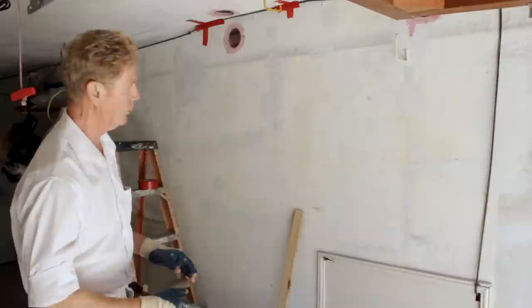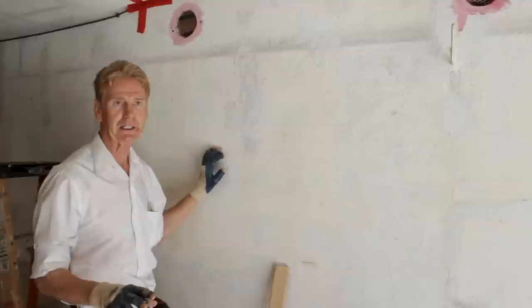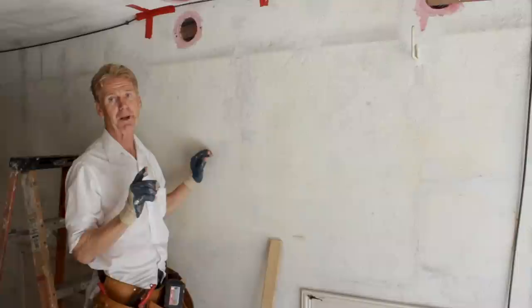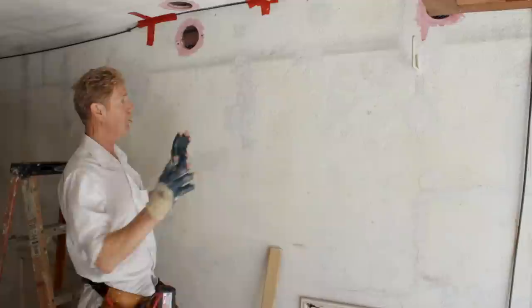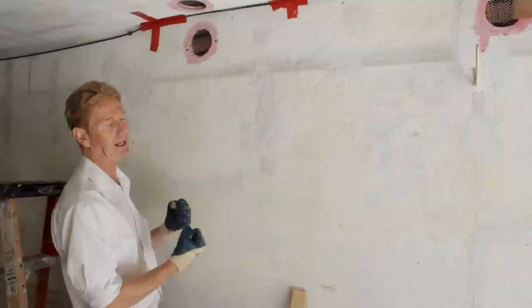The folks here called me — Kirk, what are all these little holes? I said, well, if you've got little holes all over the sheetrock, that's button board. Button board was usually about 1950 to 1960. The same theory — the holes in the button board allowed the plaster to go through, adhere to the board, and mushroom in back of those holes. That's why it's called button board, and that's how it gave more adhesion. It would stick forever. That stuff worked.